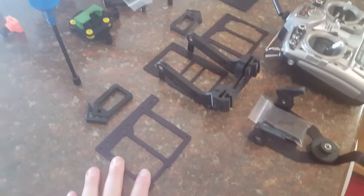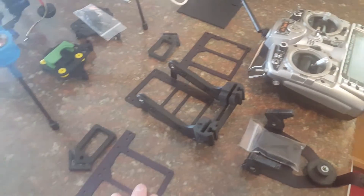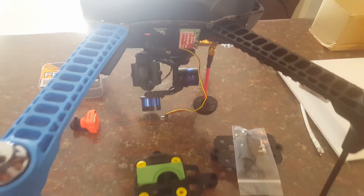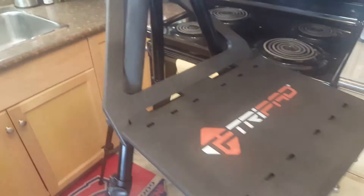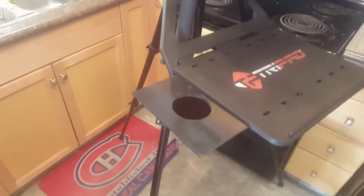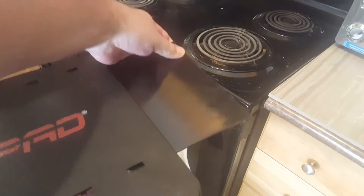I've also got an adapter here from Readymade RC. I can put basically everything on it — my UHF receiver, it's got two wings for radios and receivers, and I can put another monitor on it. On the back goes another mounting plate for my 1.2 GHz antenna for my plane. On my Iris I'm still going 5.8 GHz with a 600 milliwatt. Once it's all put together it can mount on a tripod as a complete ground station, and it even comes with a beverage holder on both sides.